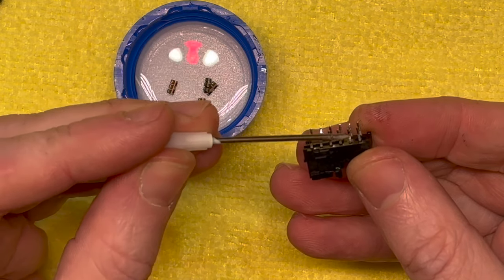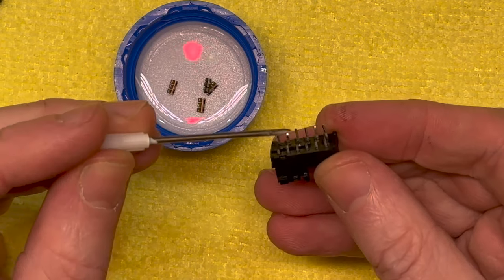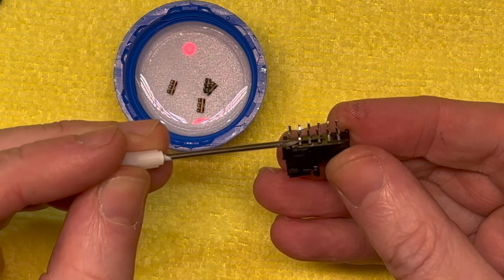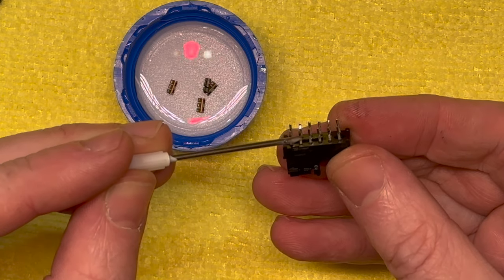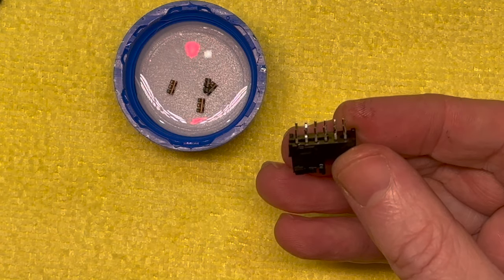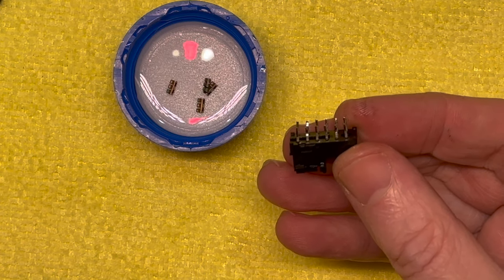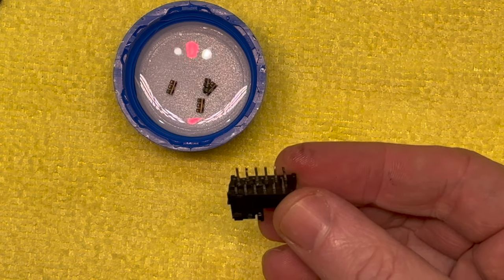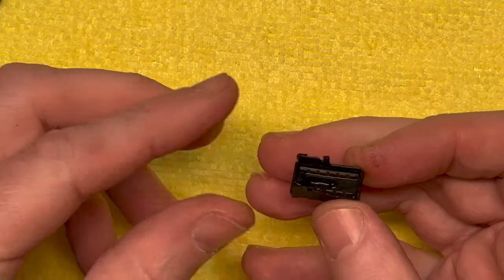So you got one here, one there, and they're all center pins. And depending on the switch location, it'll bridge that pin or that pin. It's just basically mirrored across all of them. So yeah, it'll just move across and latch that one, or it'll move across and latch that one, and they'll all do the same thing. So it's good for left and right channel in this case because it's balanced. So you've got four sets of contacts you need to switch. So yeah, I don't know if I explained that very well, but that's how it works.